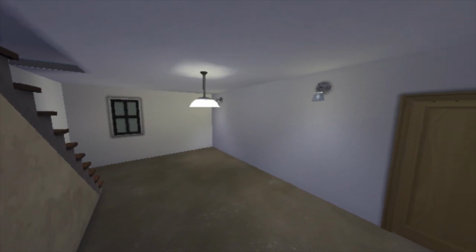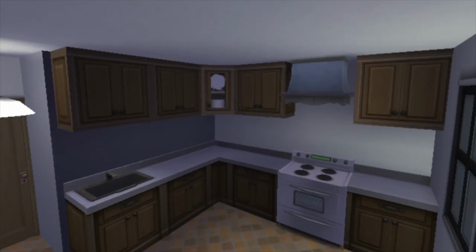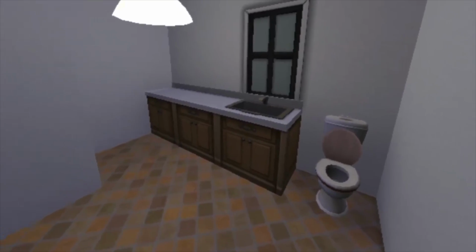Time for a recap, ladies and gents. If you're new here, these are the floor layouts of the house prior to the wall being removed, and this is where the steel will rest. Now, most people would settle for a nib, which is in effect a pillar that steps out from either wall and the steel is lifted into position and rests on.